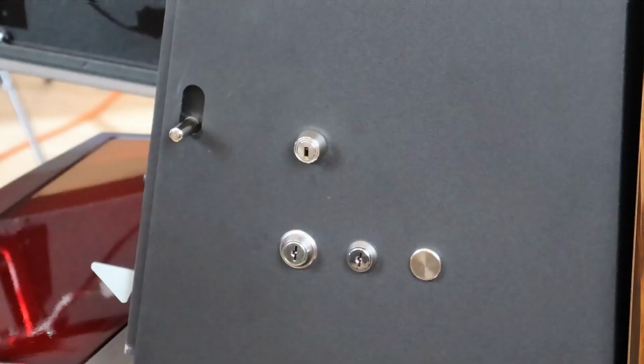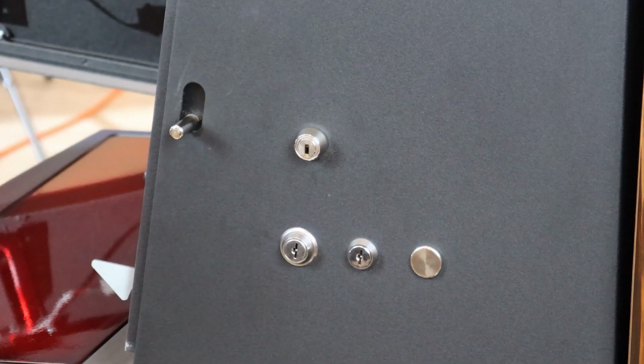For this next step, we will be using the quick change key to perform the rekey. But first, verify the directional turn on the lock with the existing operator key. On a LSR 2000, a rekey can only be done if the lock has a full 90-degree right-hand rotation.